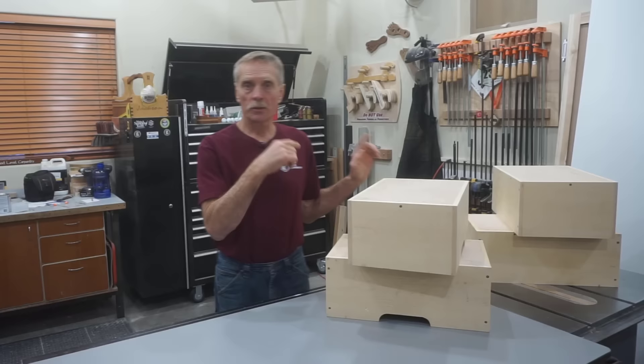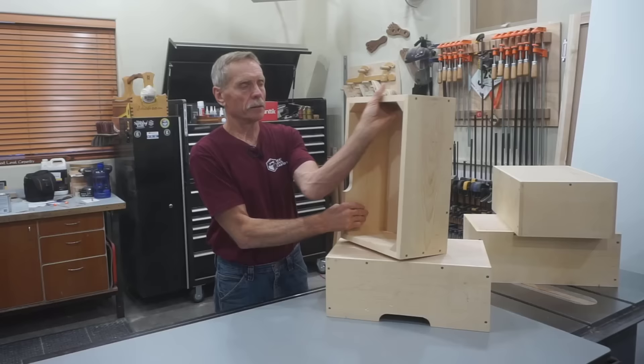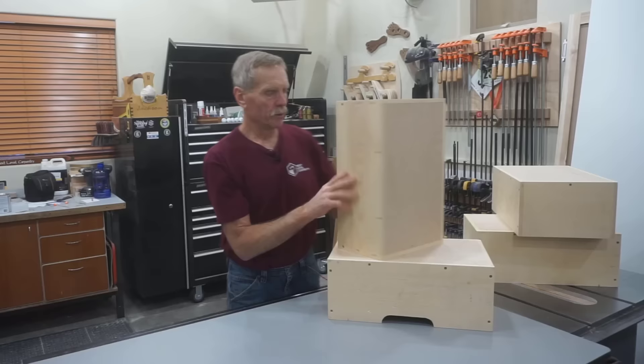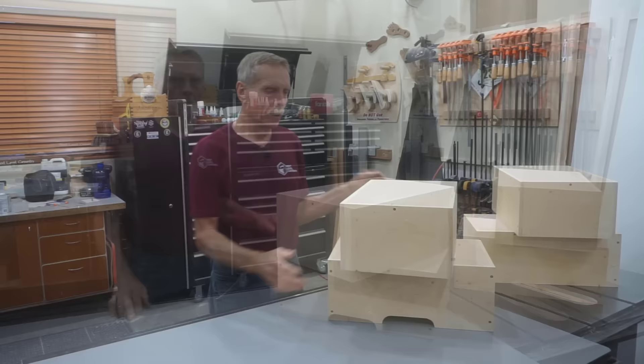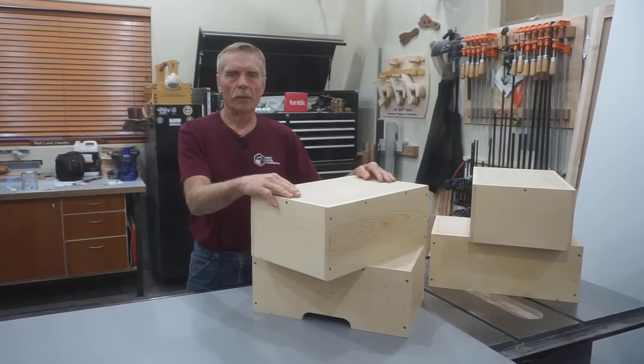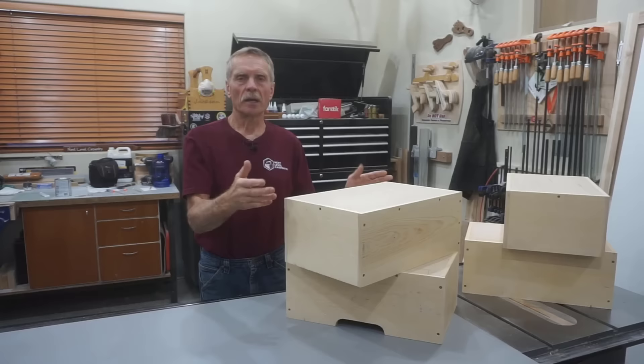In my thinking, the laminating process starts where the building process stops. These are what the boxes looked like before they had laminate on them — just made out of one-by pine with a plywood top. I put gussets in the corners to hold some feet, but it's basically just a sturdy plywood box. As far as woodworking and assembly goes, these boxes are done. But for laminating with Formica or high pressure laminate, the substrate needs to have certain properties so that it stays where you put it and doesn't fail during use.